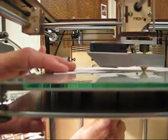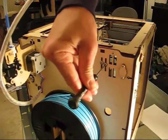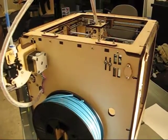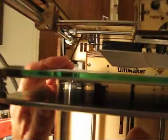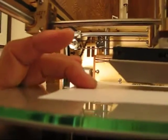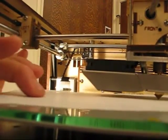That's how you know it's aligned correctly. These are the two limit switch screws here. After you've already tightened them, come back one more time and give them that last little snug, because if that limit switch moves it's going to mess up your print. Nice and tight. Re-check it one more time — paper thick, and it clicks. So the extrusion head just touches the paper on the glass platen. That's what you want.